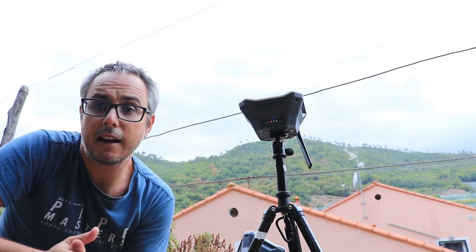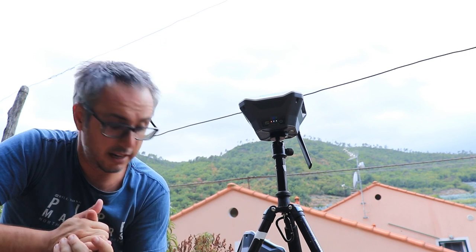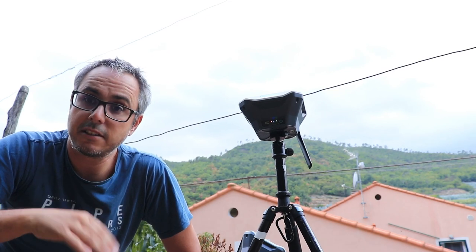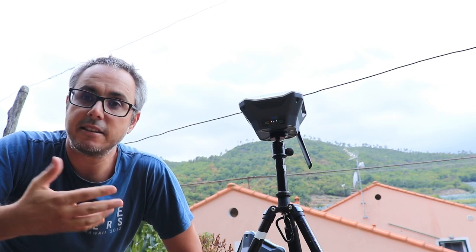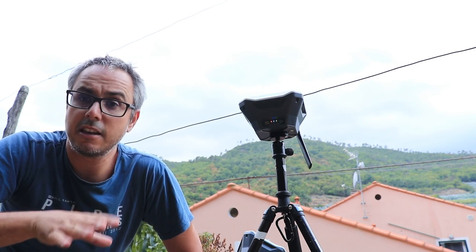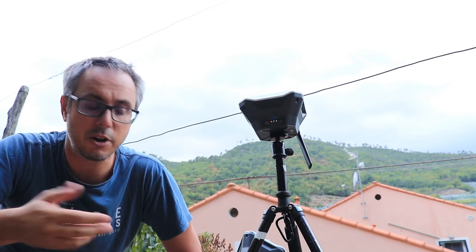But today I'm gonna show you how to connect to an NTRIP service. Here we are in northwestern Italy, and there is a service given by the region I'm at, Regione Liguria, which basically broadcasts corrections for any kind of GPS. I subscribed to that service. Here it is completely free. Sometimes you have to pay something for it, depending on the country where you are.